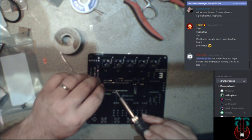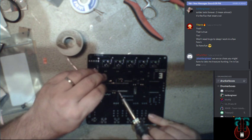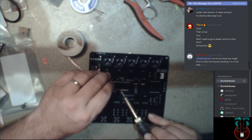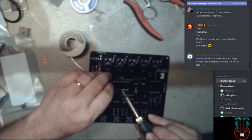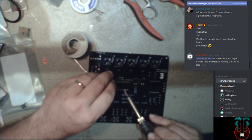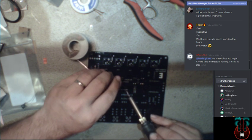Yeah. But I mean, if so, I thought you're saying bitwise is faster than writing to the port. I'm just trying to clarify. Do you mean the port registers? Yeah, digitalWrite. Okay, then that makes sense because digitalWrite is slow as shit.